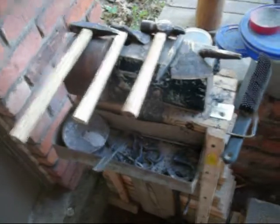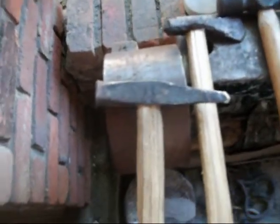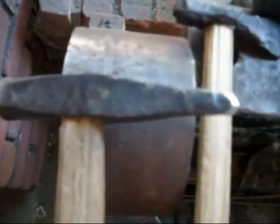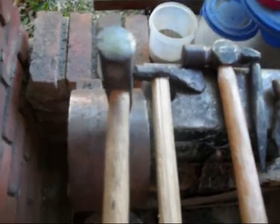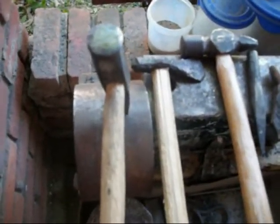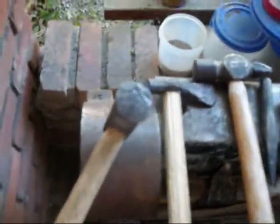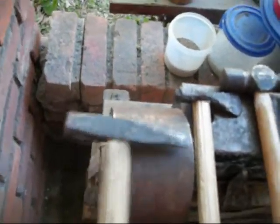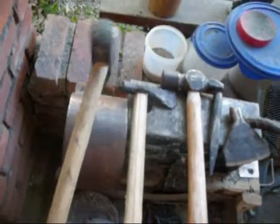Here's a few of the tools I've made just recently. This one right here was a small jeweler's hammer, a cross-peen. I drew that down into a square point and sharpened the end into a chisel point. This is what I use for punching holes through anything heavier than about a half inch or five-eighths. It works really nice. Left the backside soft, obviously, so it doesn't keep chipping and cracking on me. That's just put on a piece of 2x6 that I packed off with a hatchet.